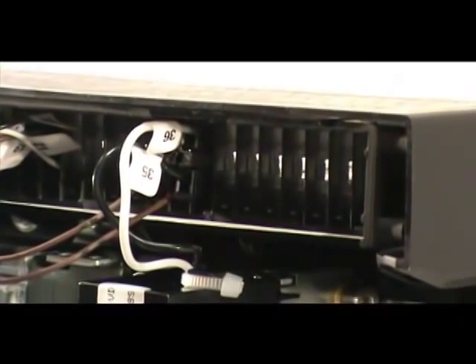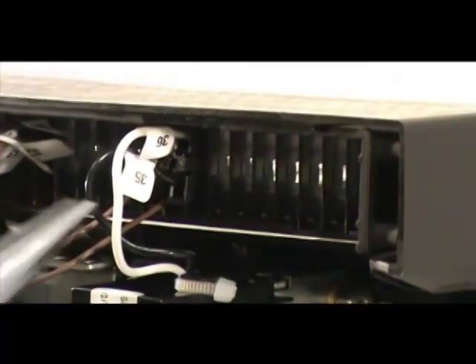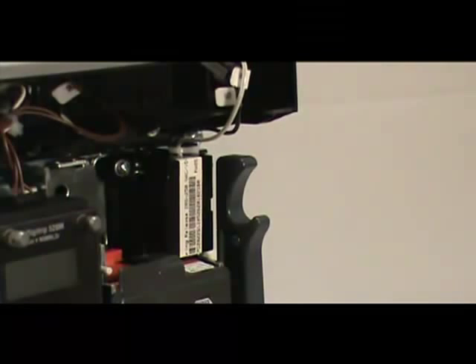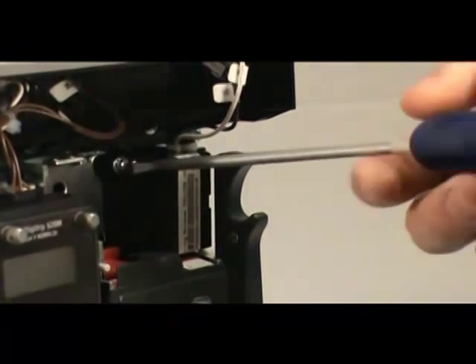Use your pair of needle-nose pliers to squeeze the plastic tabs on the lead and disconnect. Next, use your flat blade screwdriver to unscrew the captive retaining screw from the spring release and remove it from the circuit breaker. If you pull the charging handle forward, it will be easier for you to pull the spring release out.